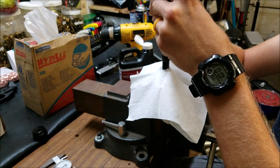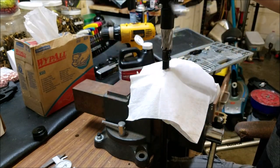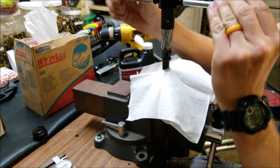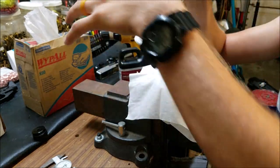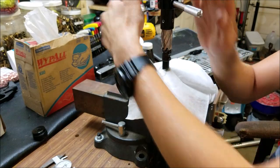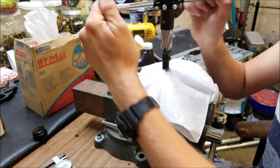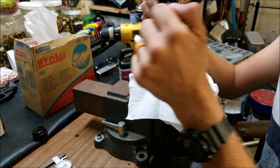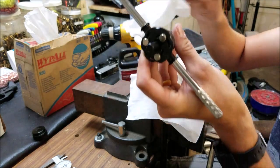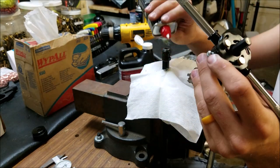This tool is extremely sharp — you really don't want to put a lot of downward pressure on it, just let it do its thing. You can really control the speed and everything a lot nicer when you do it by hand. I also want to get a perfect depth on my cut because I want to leave a specific shoulder. Depending on what suppressor or muzzle device you're going to use, it's going to warrant a different size shoulder, so you need to look up a threading guide for whatever muzzle device you're using to determine what kind of shoulder you need.